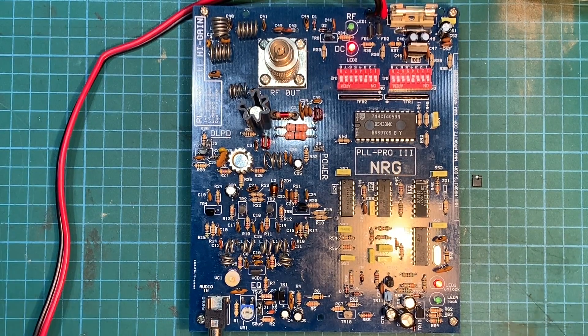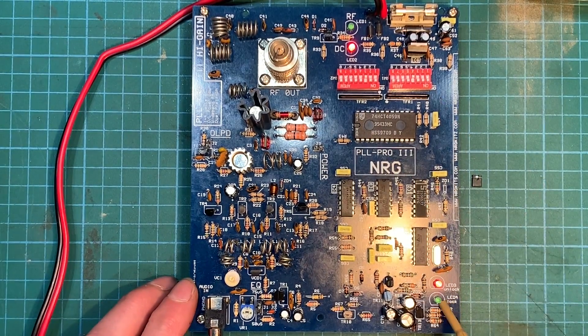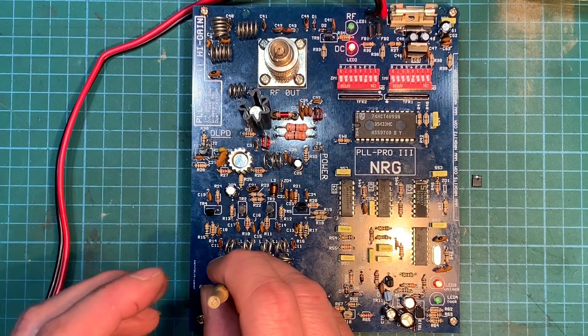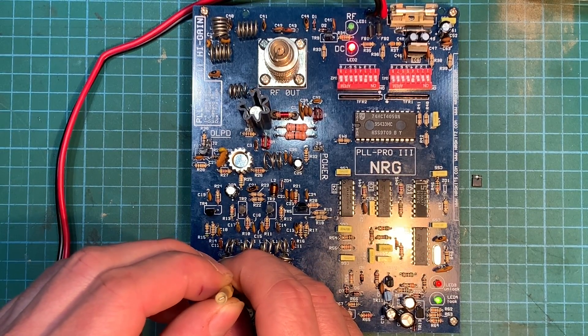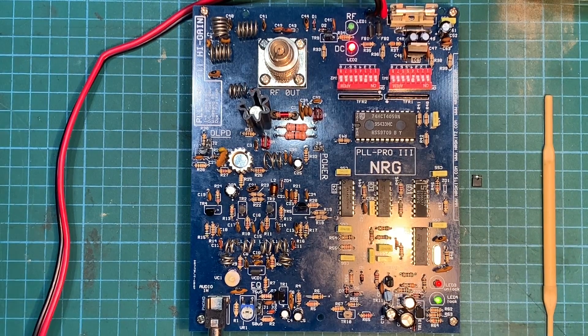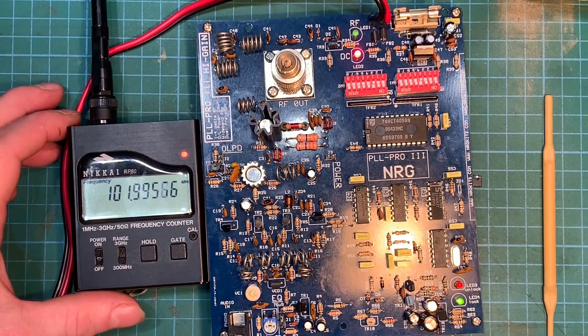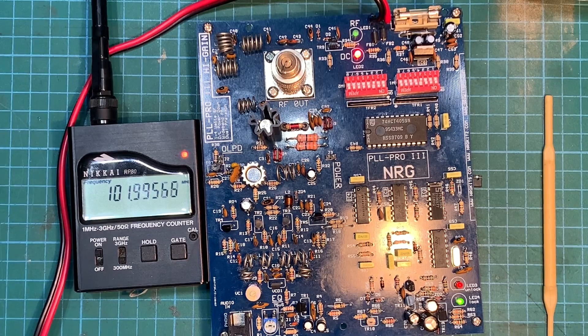Okay, let's switch it on. So we've got a red LED on there — 12 volts coming in — and we've also got a red LED here meaning we're not locked on frequency. You won't see any RF output until this green LED is on when you're locked on. We need to adjust VC1 until it flashes on — turn this very slowly. There we are, it doesn't take much at all. We're locked on frequency now. Let's get our frequency counter — it is working. Pretty much 102. Not bad. So we'll wire this up to a power meter and see what it's doing.